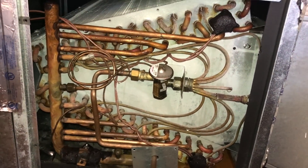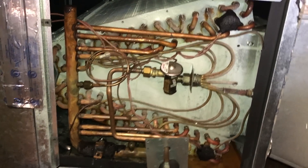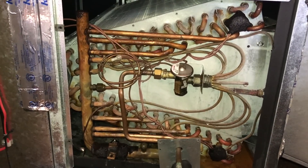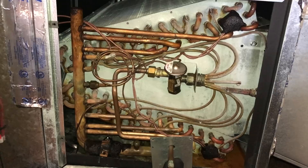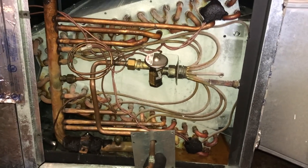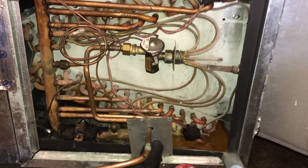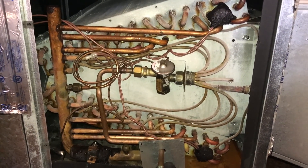I've got no airflow, and you can see some of them don't even look like they're getting cold. That's a problem with refrigerant flow in this coil. You can even see on the suction part where everything comes back out — some of them are freezing and some of them are not.